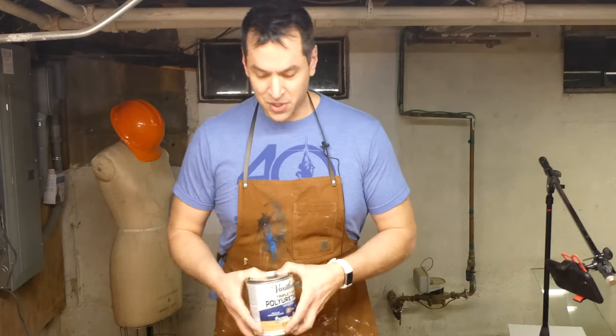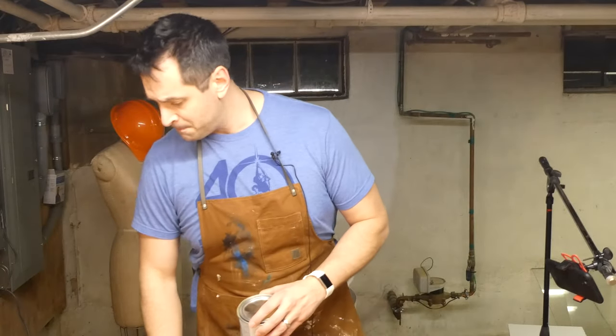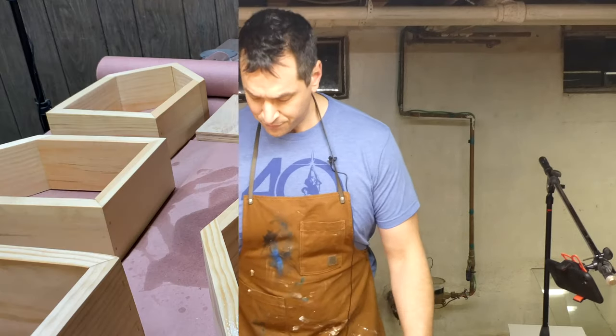So I'm gonna stir this up. You shouldn't shake this, by the way. You should hand stir it, otherwise you're gonna get bubbles. And nobody likes bubbles in their polyurethane. So, okay.